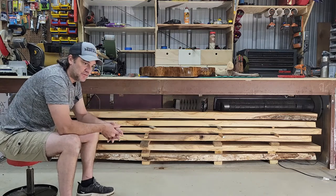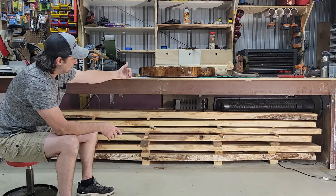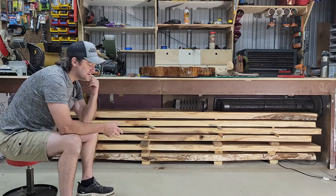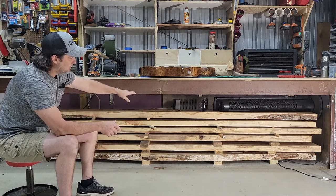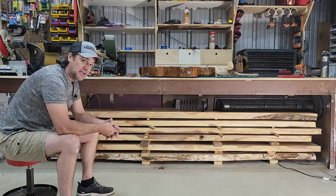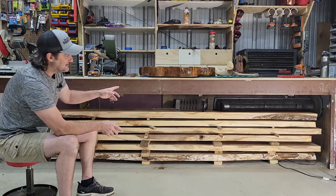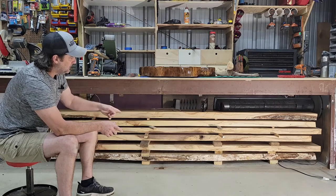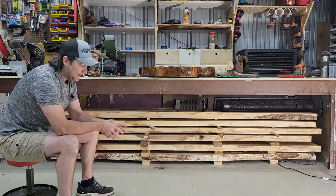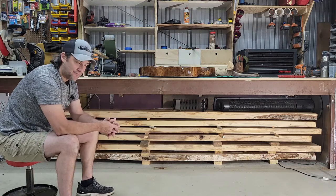I'm probably going to put another set of fans down on the floor to get better circulation, because I've noticed the wood on the top is much drier than the ones on the bottom — I'm not getting enough circulation. I'm going to show you the basic readings from each piece, then probably pull off a couple from the top because I think they're done, and reallocate airflow fans to try to finish this off.